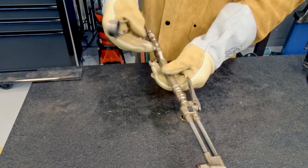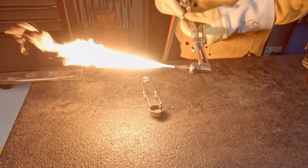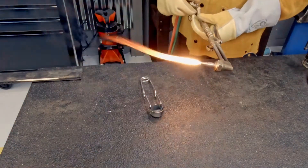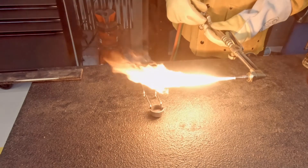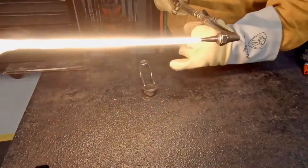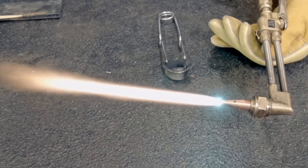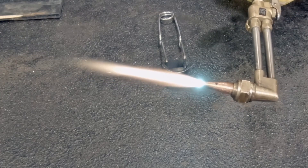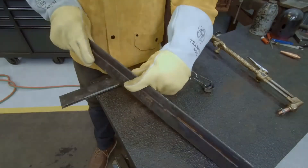Let's fire this thing up — we're going to turn on our acetylene at the bottom and light it up. Here's the best way to set your flame: make sure you're at a nice flame, then increase it until that feathering or smoke starts going away. Once that starts going away, that's a really good place to start with your valve openings. Now we're going to open up our oxygen. You're going to see the cones coming off these orifices — you want to make sure those flame cones stay on the tip at all times, nice, sharp, and defined. You can hear that distinct sound.